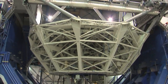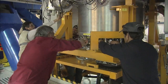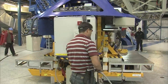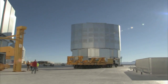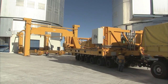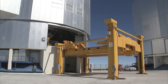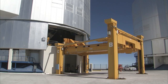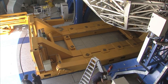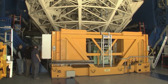First, the telescope must be prepared so that the mirror and its cell can be taken out. The team is removing an instrument attached to the mirror cell. Outside, a custom-built carriage is moved into position. This carriage will support the mirror and the cell, cushioning the load during transport. A dedicated platform lifts the carriage to the mirror deck. When it reaches the deck, the carriage slides into the building on a stream of pressurised air, ending up just below the mirror and the cell.